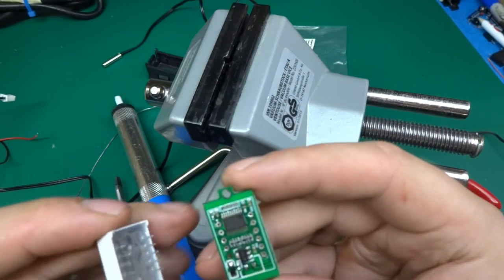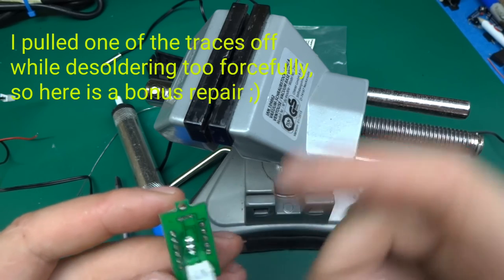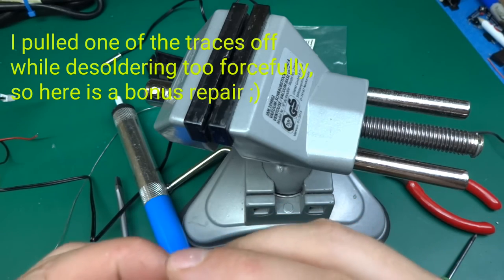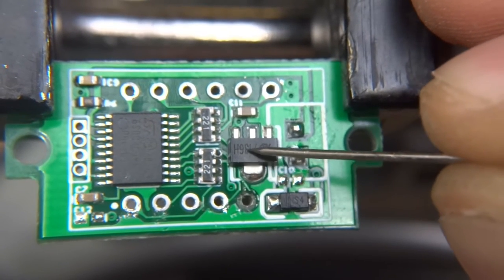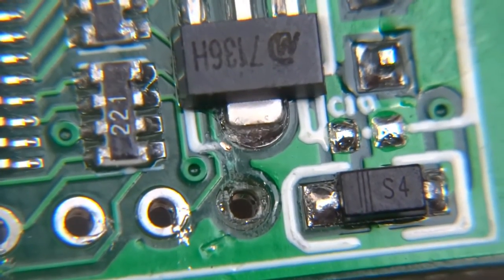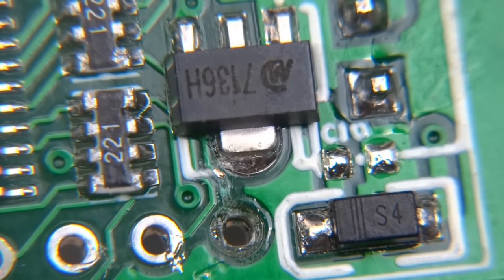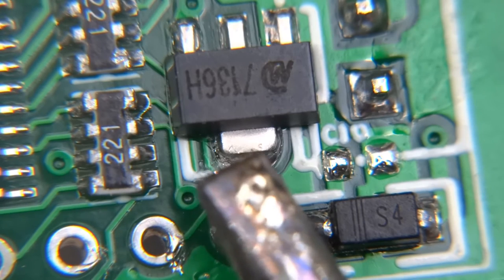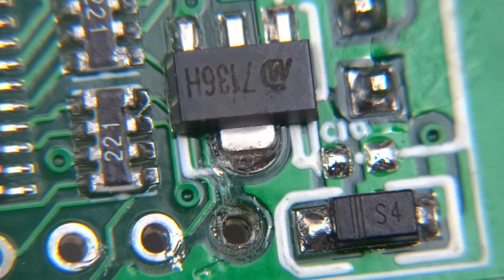So there we go — that's been cleaned up and now it fits just as intended into the holes. I would have just soldered this back up, but I messed up a trace — how silly of me. I need to figure out which trace it is; it goes under the voltage regulator, but I think it's this trace from the resistor ladder. I've got a tiny bit of copper exposed here, but it's way too close — there's a big risk of shorting onto the tab of the voltage regulator.